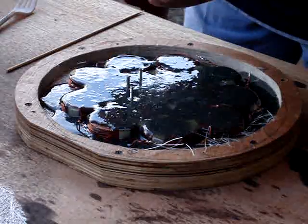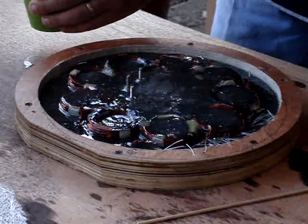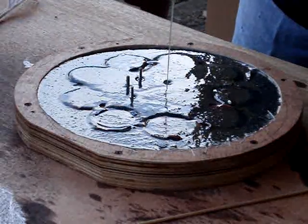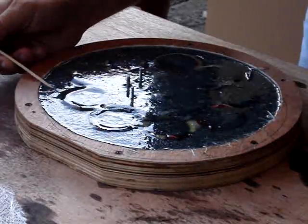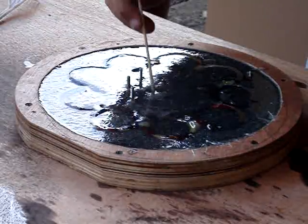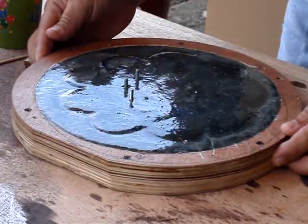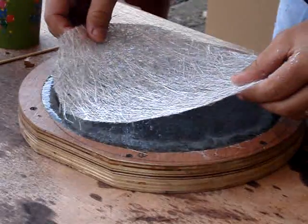I ended up using about three and a half cups of resin, mixed up the same way as in the test stator portion. I lift up the coils just a little bit again to get the bottom mat saturated. After I get the last bit in — about three and a half cups — I shake it a little bit and put the top mat on. I had already made little holes in the mat so it would fit on nicely and easily.